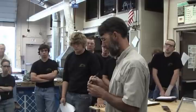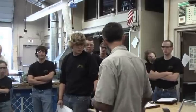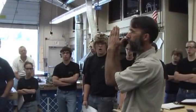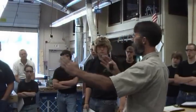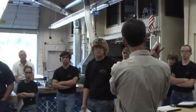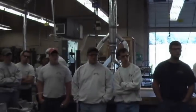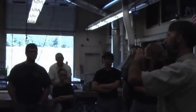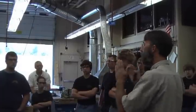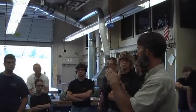Okay. I'm going to do a little black. I'm going to see if my tool rest is adjusted the way I want it to be. You can change the angle of that cutting edge by changing the tool rest. We can get a really, really fine knife edge. What's the downside of that? It doesn't last, because it's too thin. It's actually brittle. If you become teachers in a high school program, these kids are just brutal to your tools. Make it coarser and it'll last longer, but it may not be quite as sharp. So there is a happy medium there.